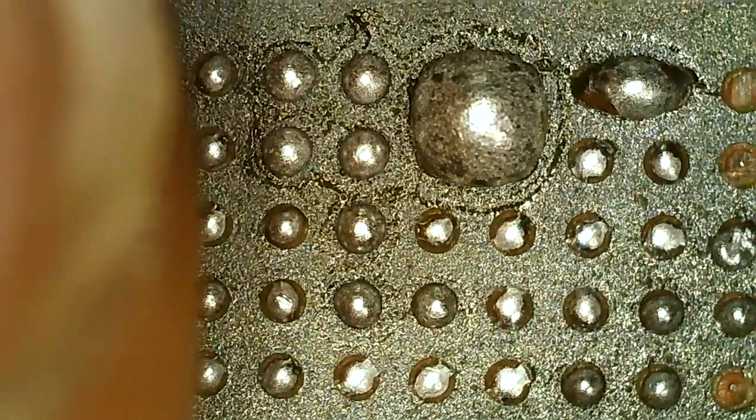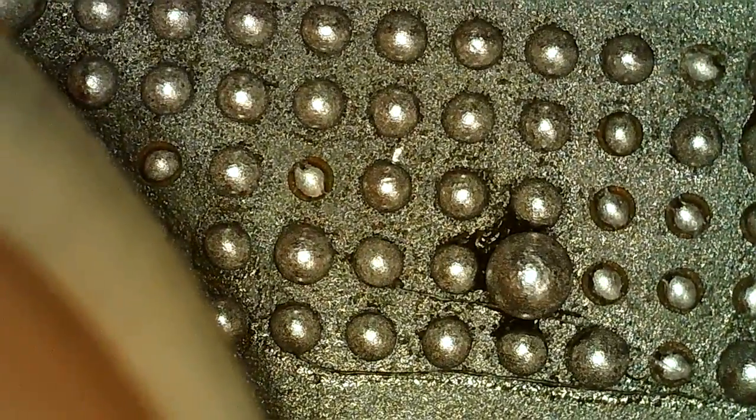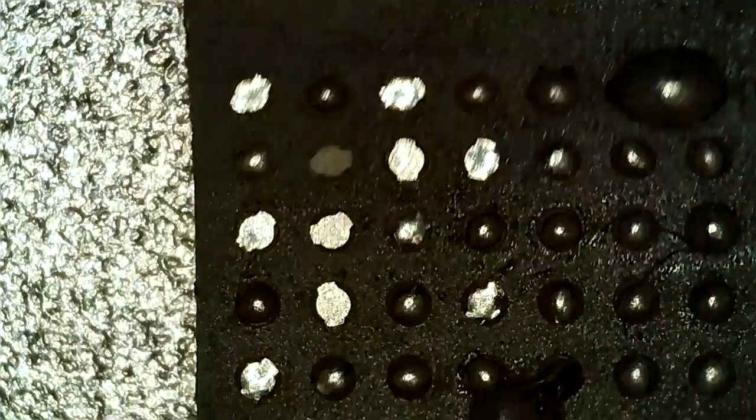I was quite nervous taking this off. I might have been too hasty. But yeah, hard to tell because this can apparently happen. The pads get ripped off when the board flexes, so they might already have been broken. But yeah, this chip isn't usable, and I have checked on eBay. One of those is about 20 euros, so I guess I'm buying new RAM.